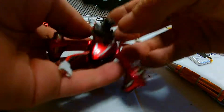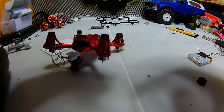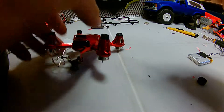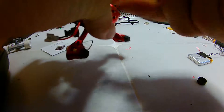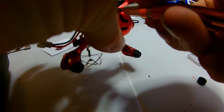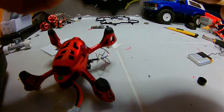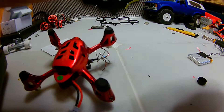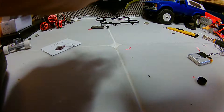It works if you just bend the motor out slightly, and then it clicks back in nice. Then stick these two screws back in. I think it's going to work all right. Hopefully I just don't get any signal noise coming through the FPV feed. If I do, I'll mount a little external battery and attach that straight to the camera, or put an LC filter in the way of the wiring — that should solve the problem.